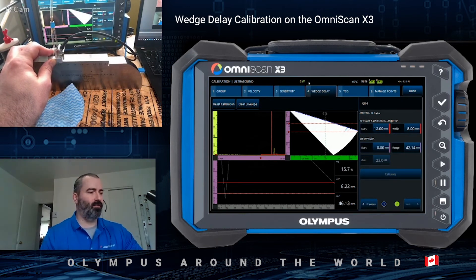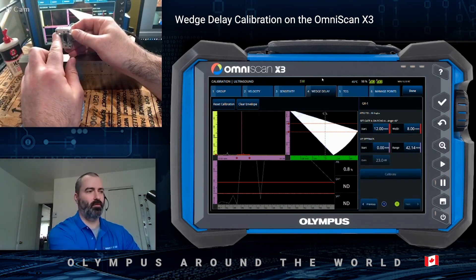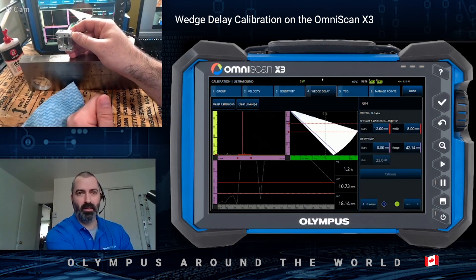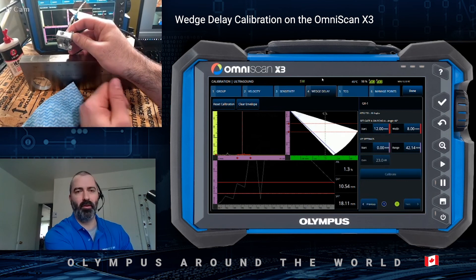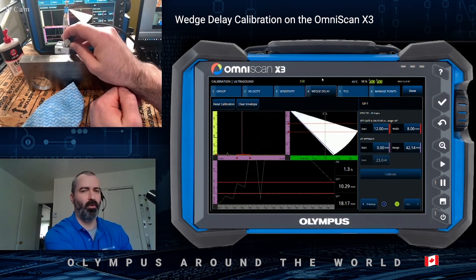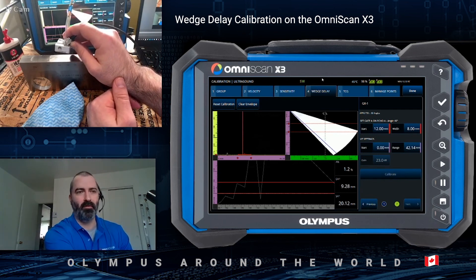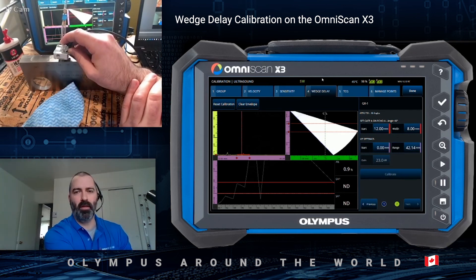Just a quick trick to have reproducible results: you want the probe to be as perpendicular as possible to the reflector or the block. In my case, I used the two carbides to actually glide on the edge of the block. You can also tilt the block on its side; however, the couplant may not be as regular as with the block standing vertical. You can also use a ruler or some kind of device to press it against both the probe and the block to make it steadier.